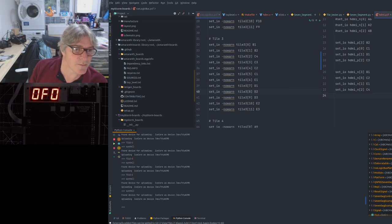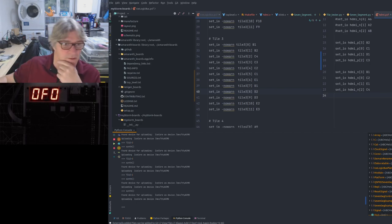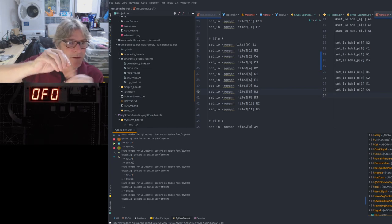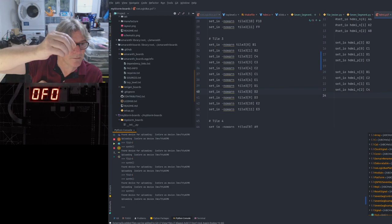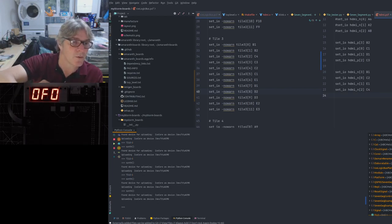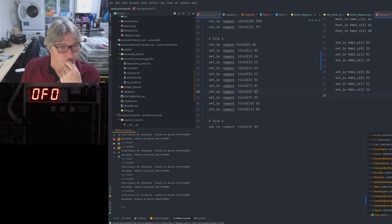I think I would probably prefer the male upright one, but it all depends. Because it's on the top of the board anyhow, so it's just easier doing it upright. What I'd probably do is I wouldn't solder it in. I'd take the male upright one and stick that in the end of the ST-Link 3 IDC. And then when I want to program it, I just put that on the board and it will hold it in place because the holes are offset. You don't need to solder them. That's the easiest way.